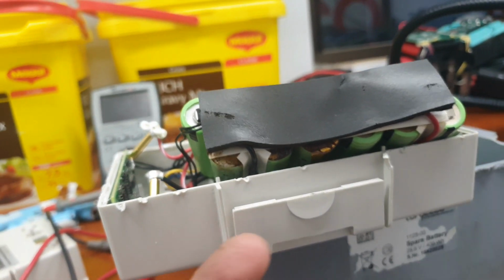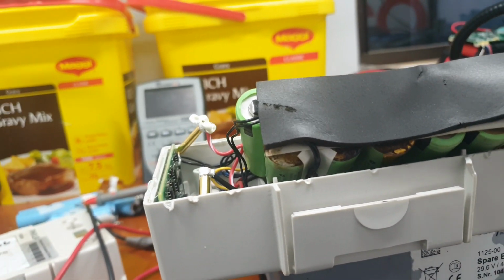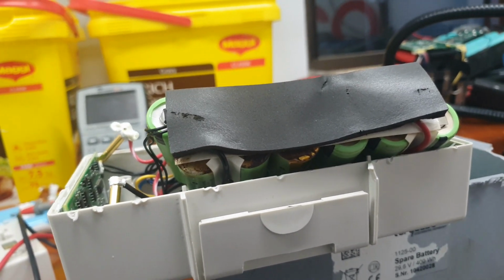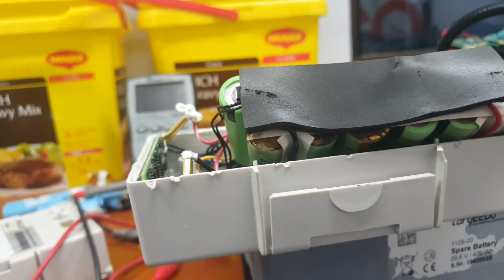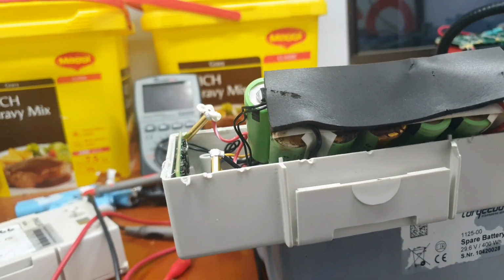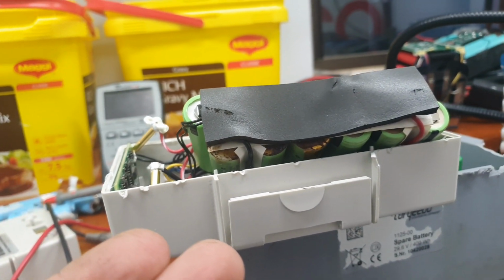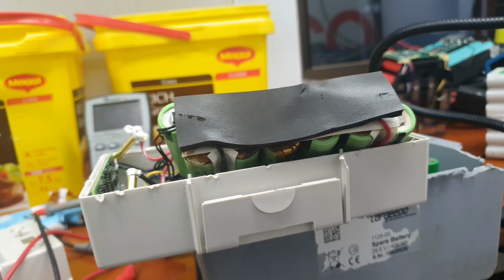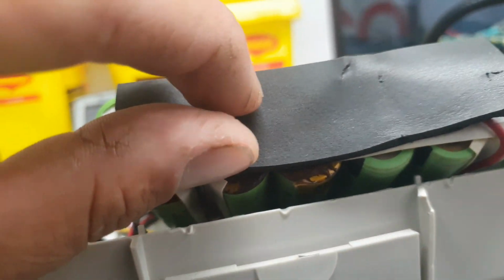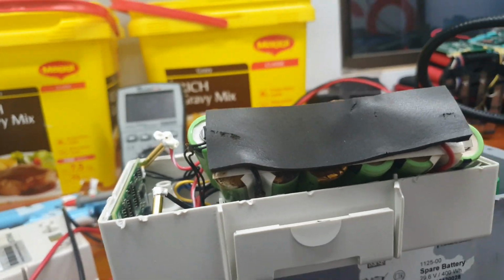Once it does that, well, they'd be full of oxidization because they're open. Essentially, if there's a hole in it, it's coming in and out. Remember, we're at atmospheric pressure right now, which is like 100 kPa at sea level, so I pretty much live on sea level. So atmospheric pressure, or zero pressure, is still 100 kPa trying to get inside that cell. Especially with things that have got a solid outside wall. You know, if it can leak when it's charging, it can also suck in whatever, which is probably why it got decommissioned in the first place. A lot of them are for age, but obviously they're going to wear out as well.